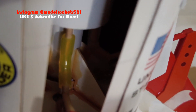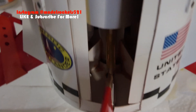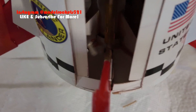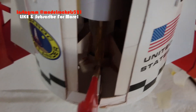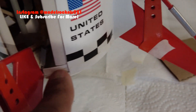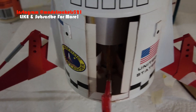I noticed another issue: if you push the ball and the dowel too close together, the bearing will rub on that silicone material over time and wear a hole inside there. I left little gaps in mine - it has little spaces - and it still sits perfectly, giving room to move up and down without too much stress rubbing on the silicone. So if you build one of these, leave a little gap between the wood and that ball on both sides - don't push them in too far. But it's in place - now I just need to glue this section here and run a line of glue along the bottom seam, then seal up the cut lines.